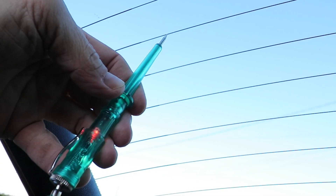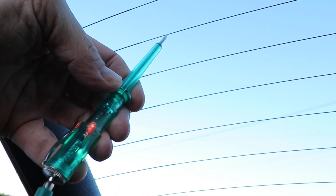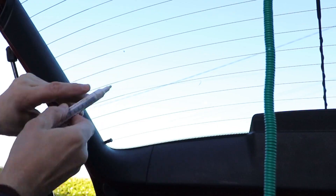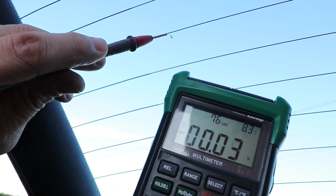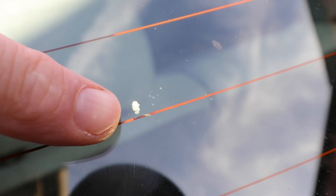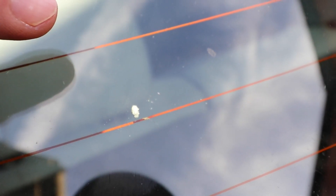When I've pinpointed where the break is, put a mark on the glass or just next to it. This is a clear break, but sometimes it's not as clear cut as that. The light may dim in some parts and then brighten up further on — this will also indicate the break, which would need further visual inspection. You can also do a visual inspection of the outside of the glass; in this case with a bit of sunlight, you can highlight the discoloration just where the break is, which in this case is quite clear.